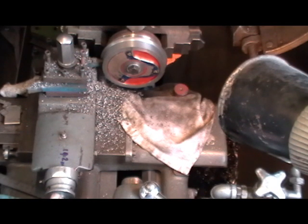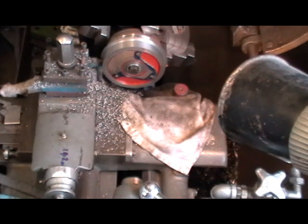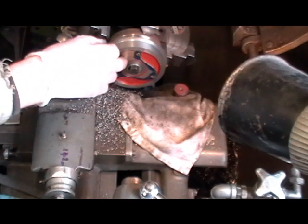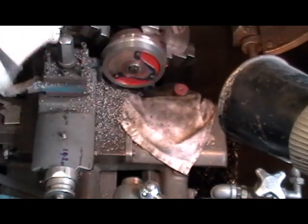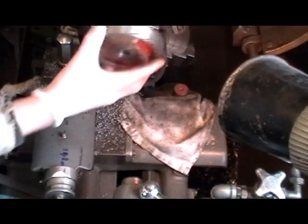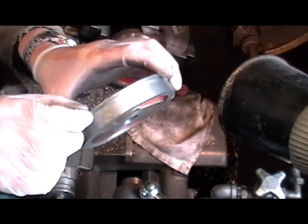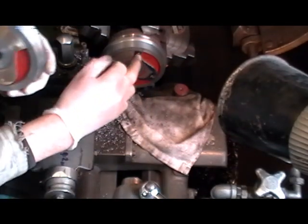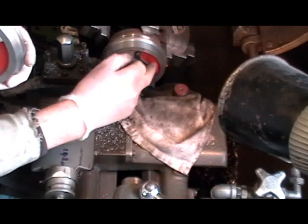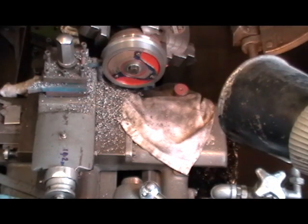Just getting the chatter marks out. That's it — that wheel is now identical to this wheel. I'll take this out, put my next wheel in, and so on. Then I can put them all back in again to put the radius on the outside of the flange and chamfer the front edge. On the others I can then machine the heads off the screws — I've done that one, that will be the prototype. Just a little tip there — it may help somebody.